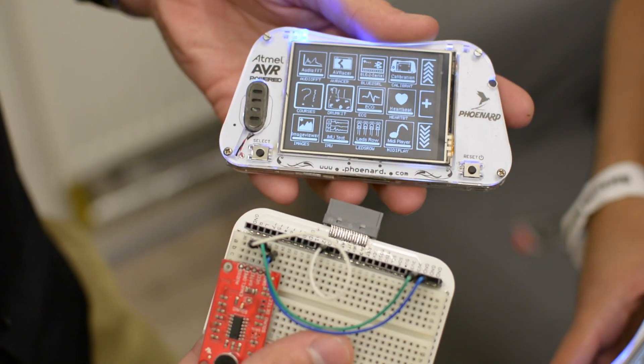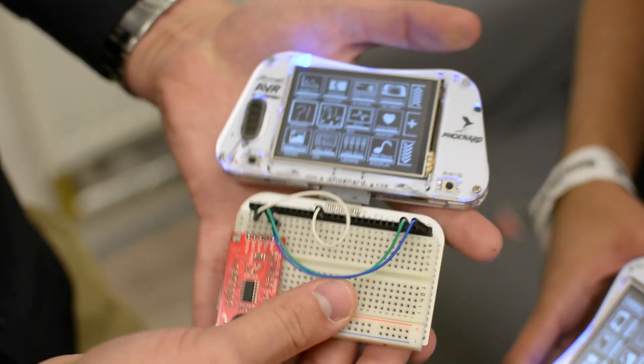What we did — we took the Arduino, took the chip off it, and replaced it with a bunch of peripherals: Bluetooth, GSM, touchscreen, MP3/MIDI player, SD card, and a 10-DOF. Everything together fits in one nice device, and you can upload and program it with your Arduino IDE. It can actually store thousands of sketches, because we made a custom bootloader that stores them on the SD card.